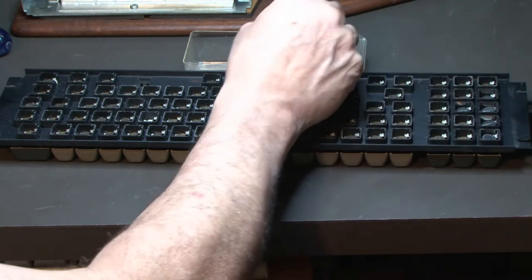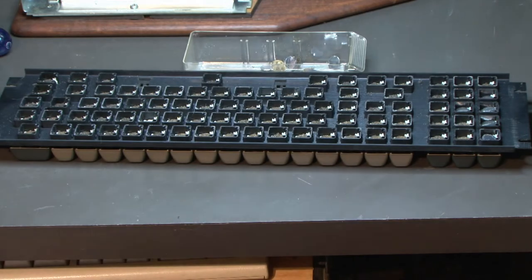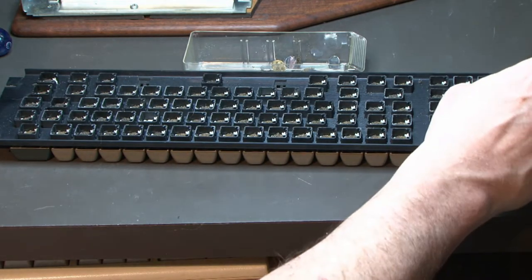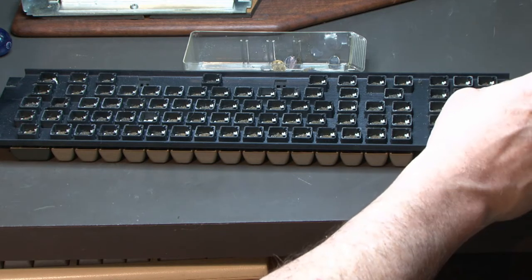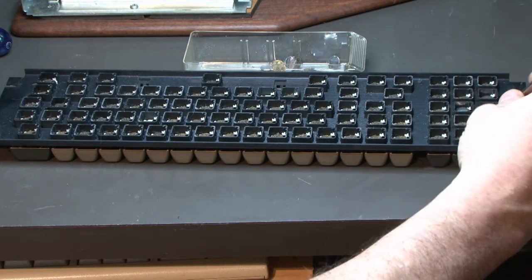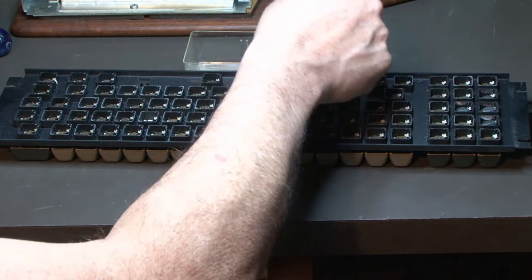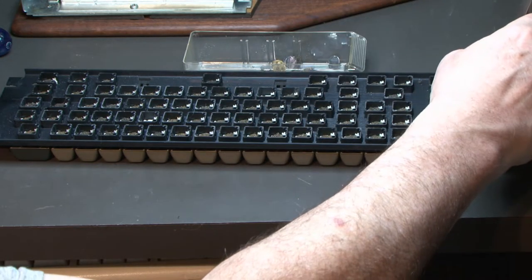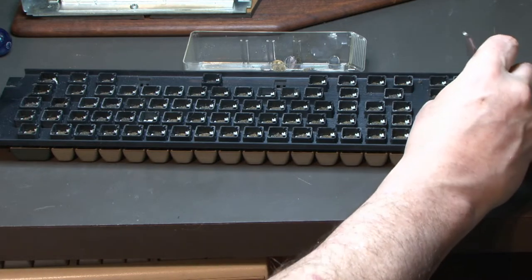We're going to run that in there. That way we can get the 48K RAM. What they did, which is another weird thing, is they stuck their ROM, their BIOS or however you want to call it, the ROM monitor, at C000 in hex, right in the middle of the address space.